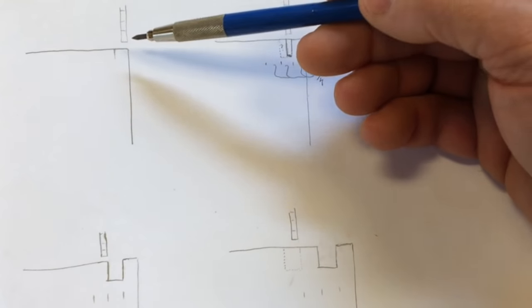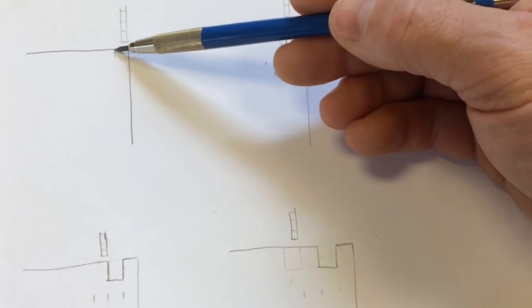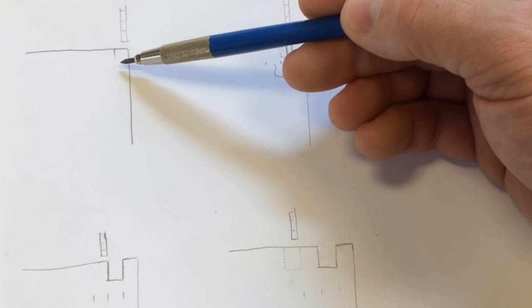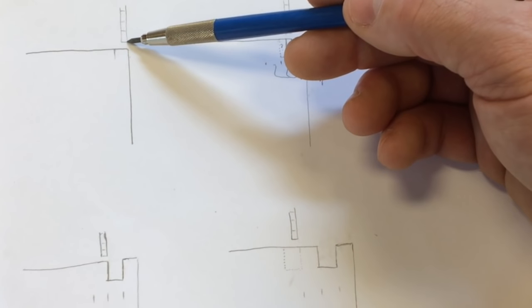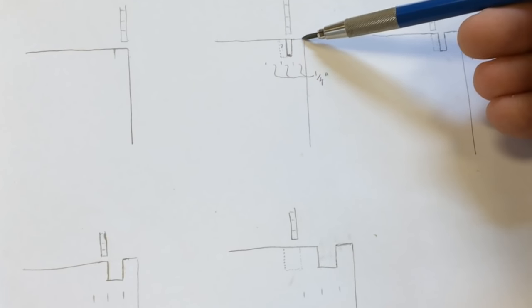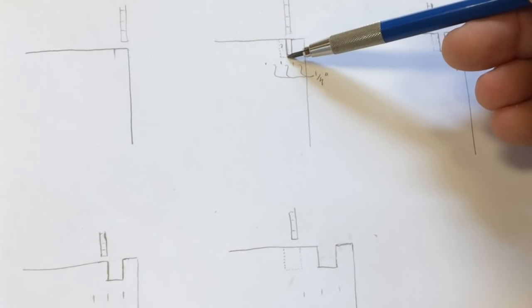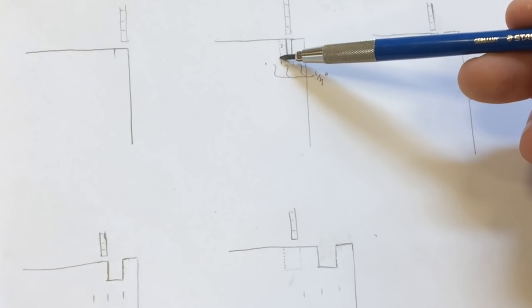To start with, we want to line the blade up with the edge of our board. You don't want to make that cut because this first one is going to be a finger. We're doing a quarter inch in this example, but you could refigure this for any thickness finger. When we do a full turn on the 48-tooth gear, we're going to move exactly a quarter inch and get a quarter-inch finger, with the blade lined up right where we want it. We go ahead and make that cut to cut out the slot. Then the tricky part comes in — how do we cut this next piece?